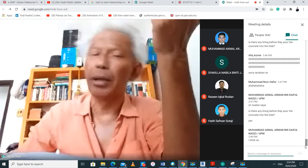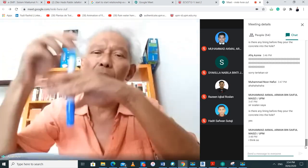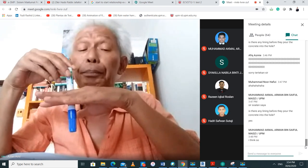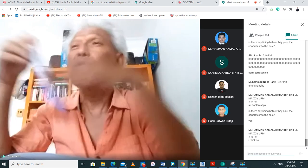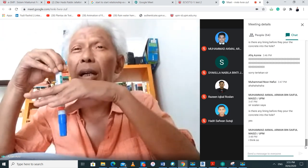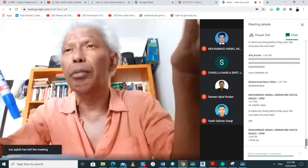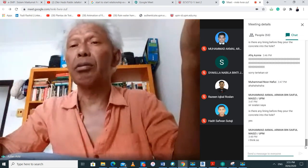The dynamic formula is because we said to ourselves, we're going to drive the pile in, bang, bang, bang. So we're going to give some dynamic energy to the pile, and we're going to derive formulas if it is possible to do that. Why do we need to do that? Because since we're going to drive it, if we can make an equation of the energy I give to the pile, I can make a formula out of that. Then I can check on my static formula, and if I were to have this pile load test, then I can have all three methods all at the same time.